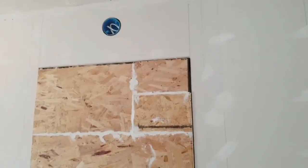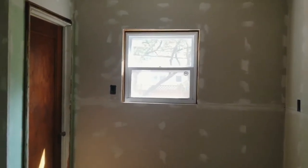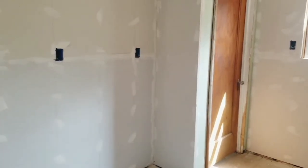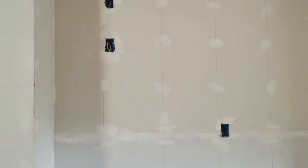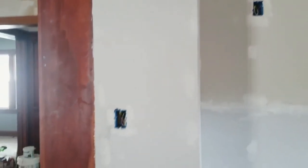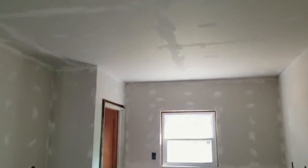This will be a light switch that I relocated. There was an electric box here and one over there that neither made much sense, so now there's going to be a sconce light with two heads coming down over the window, and that switch will control it and also the garbage disposal. On this wall, as a reminder, the fridge will go there with a little cabinet in between, then the stove. The two outlets from the previous owner are intended for a range hood and potentially a microwave. This is a newly relocated switch in the bay I created over the old brick stack — it'll be a three-way switch working with the one on the far wall, controlling can lights I'm mounting in the ceiling.